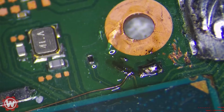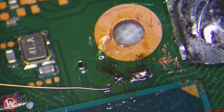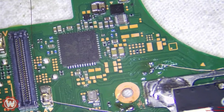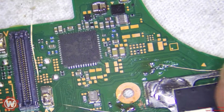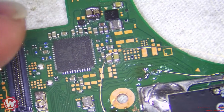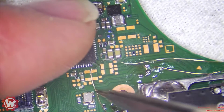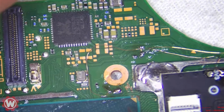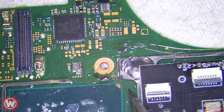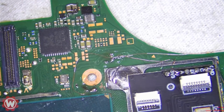That is good. So we're going to reroute this wire around the screw hole here. Carefully, because we're going to be putting the heatsink on top. So if we do this, it will be fine. We can also route it through the bottom here, but this is fine. This is point D.